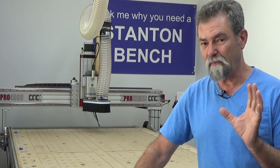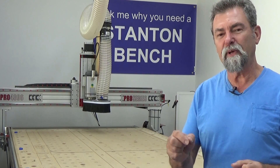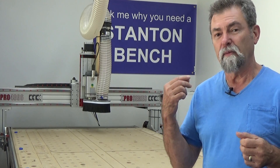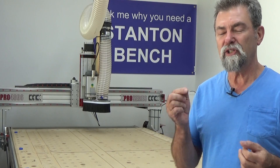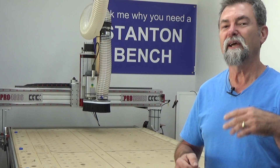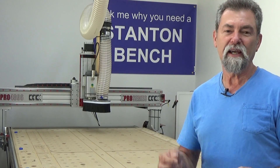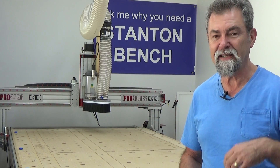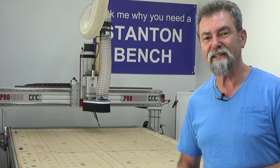Dave here. How are you? Now this is a very basic video — there's one camera in it and that's all there is to it. It was when I was doing a recent project with the CNC and I realized I had the software settings incorrect. So I stopped the machine, opened up the G-code in Aspire, changed the settings on the cutter, re-imported the G-code back into Mach3, used the touch plate to let the machine know where it was with its X, Y and Z axis, started it up and finished the job. It's a short video, you might be interested in watching it. Here we go.